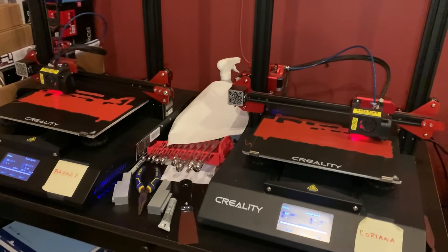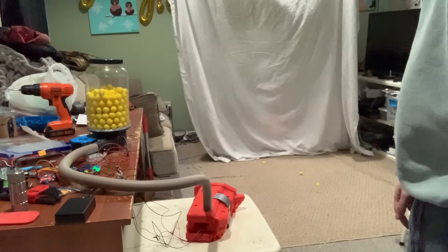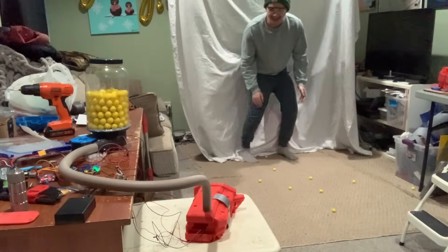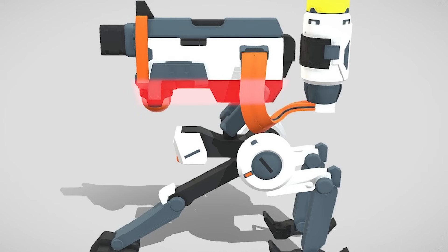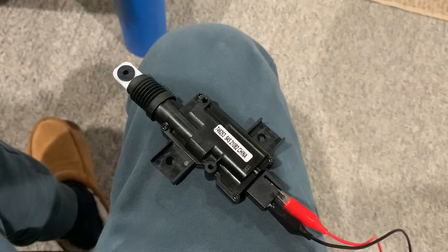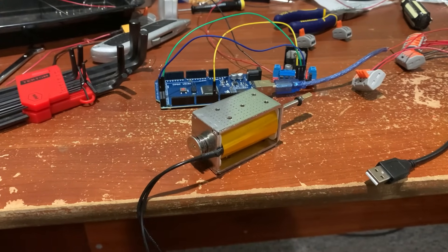I hooked up the Proton Pack and Jupiter to Timmy Mark 1 — Timmy packs a punch. For Mark 1 we used this green area, and for Mark 2 we're going to use this red area to create a recoil mechanism. I ordered a linear actuator that wasn't as snappy as I would have liked, so I tried a solenoid instead, and it seemed promising. The turret head will be attached to this linear bearing to allow for smooth railing.